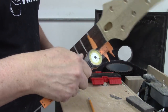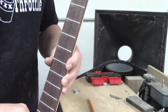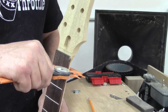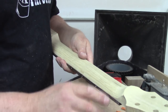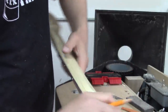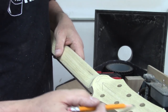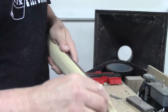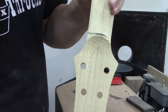All right, that's actually a pretty decent spot to stop. We want to make sure our neck is looking good and we need to have an idea of how thick we want it to be before we go too far. I'm just over 900 thousandths at the 12th fret and right at about 850 thousandths at the first fret — so my thickness is just about right. But now I need to get my profile where it needs to be. I want to make sure my volute comes under where my nut is going to be, which means I need to move this section back a little bit. We're just under 5/8ths and we need to be just over a half inch for the tuners we're going to use, so we're going to take this over to the old man machine and cheat it down a little bit.